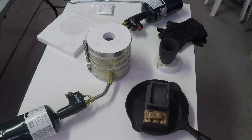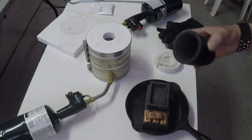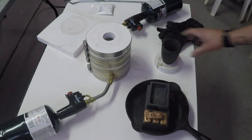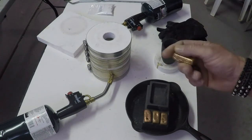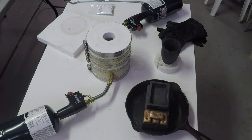The KK-6 here is powered by a couple of TS-4000 Bernzomatic torches and a clay graphite crucible that will hold approximately a kilo of silver at a time. Today we're going to fire it up and take four of these little three-ounce copper bars that I poured with the quick kiln and turn them into a one troy pound copper bar.